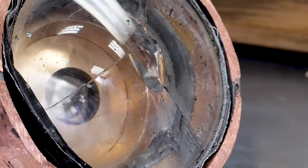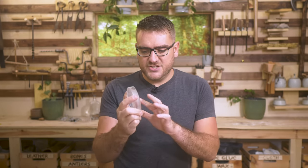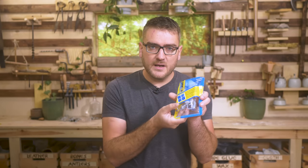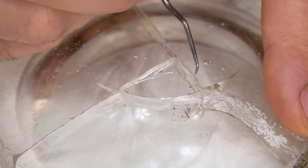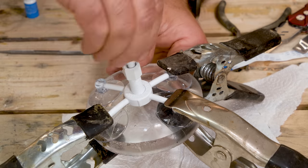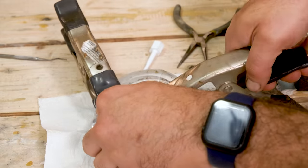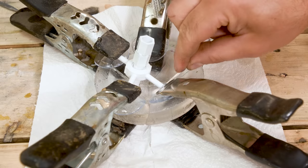Probably one of the most obvious flaws with the camera lens, at least visually, is that the outer element ended up cracking. Unfortunately, in the very final stages after hours of labor, it ended up flying off the little lathe we put together and shattered into several pieces. I was able to glue it back together and finish polishing it, and the result is actually surprisingly better than you would expect — at this point I can't see the artifacts of the cracks. A crack in the outer element isn't the most noticeable, so I'm going to try car windshield repair resin that has the same refractive index as glass, so it fills the crack and makes it pretty much invisible. This didn't end up making too big of an impact because the crack had already been glued together and the resin couldn't get all the way in. I probably could have gotten a better result if I broke it apart again and cleared out the old glue, but I didn't want to risk making things worse.